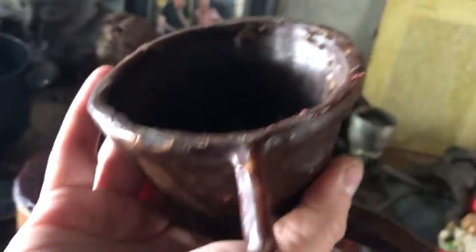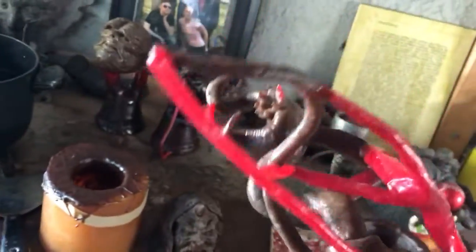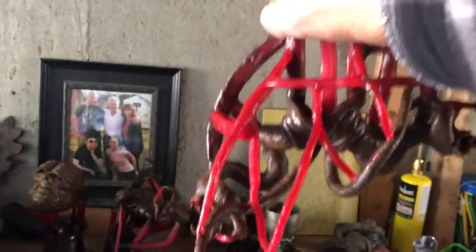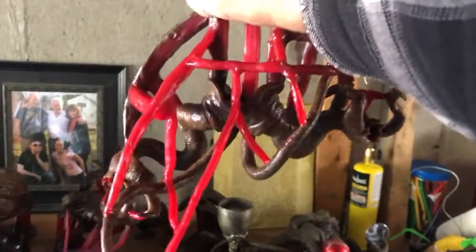This is the sprue system and the vents, which encourages the metal to push all the way up to the top of the cup, so there aren't missing pieces down here where it didn't reach. My teacher seems to think this is going to work. If they pour it really hot, and I've had a lot of luck in the past, so please pray with me that it comes out.